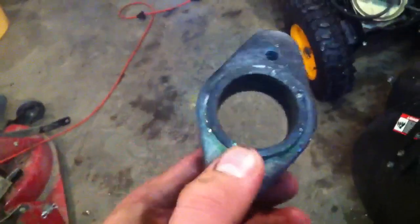He screwed up one of the auger rakes, so he replaced the auger rake and it was all moving around in there. He didn't know what was wrong with it, so he brought it to me. I took this thing apart and was looking at the little plastic bearing things. These are really stupid — these are bearings that go over the auger rakes like that. They don't go on a shaft or anything; they go on the auger rakes and they're plastic. As I said, a little too much plastic for my liking.